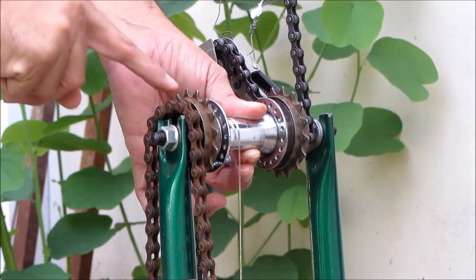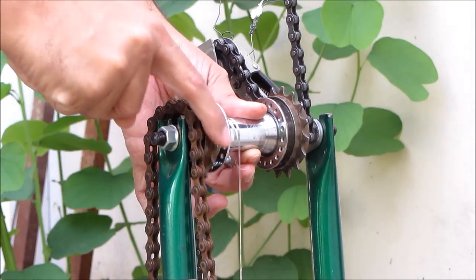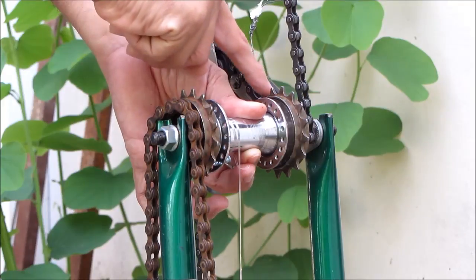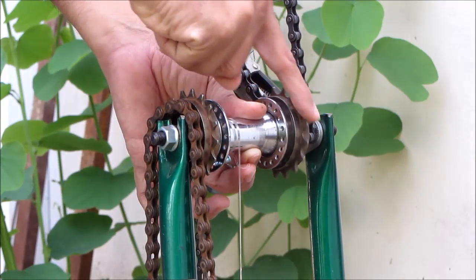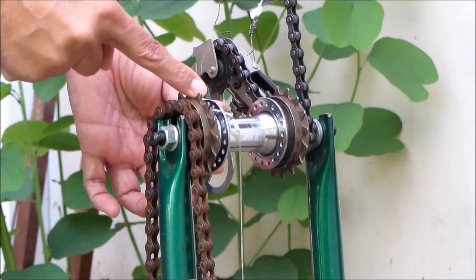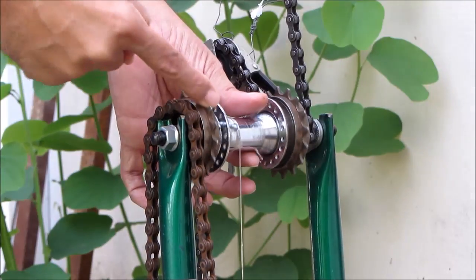You may notice here that this ratchet, also called the locking ratchet, moves freely in the clockwise direction. On this ratchet, called the lever ratchet, it also moves freely in the clockwise direction. Both of the ratchets move freely in the same direction, and since no chains are attached to the locking ratchet, the axle moves freely in both directions.